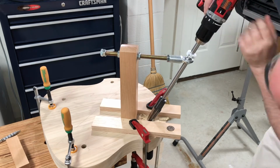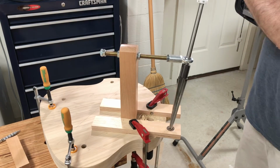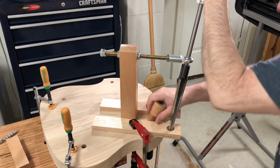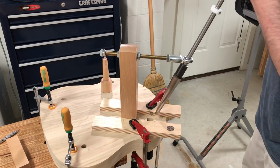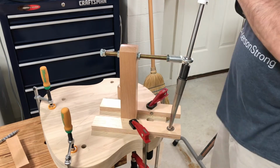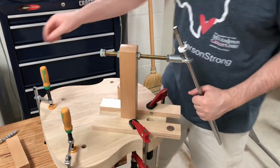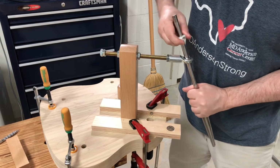So we always want to make sure that even though we do have the drill stop there, that we're constantly checking to make sure that we're also cognizant of the mark there that we have on the reamer, and we're looking at that maybe just a little bit more, so we'll give that a couple of turns and then check again, and I think we're right on at that point. So there we have it. We take that off. And again, I'm going to go ahead and take everything apart, and let's just see how we all measure up at 24.5 degrees.